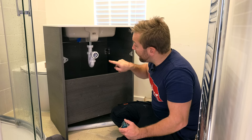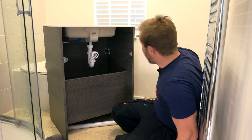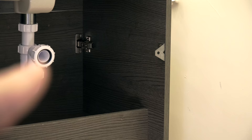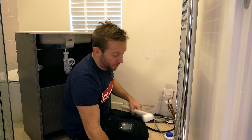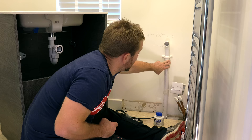So now we know within about five mil what height of our elbow going out to our trap is going to be from the wall. I'll just measure up here — 585mm. So now I know how far to bring up my pipe extension when I first fix on the wall at the back here. So we've actually got that now marked on the wall — waste elbow position. That means now what I can do is get a bit of waste pipe, and now I can say I know where I want the bottom of my elbow to go. I've put a straight coupling on there and we've got a pipe here, so we'll be able to clip that up and know exactly where our waste elbow is gonna come out.